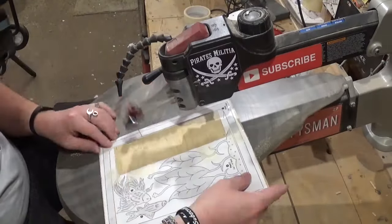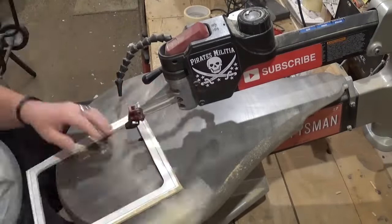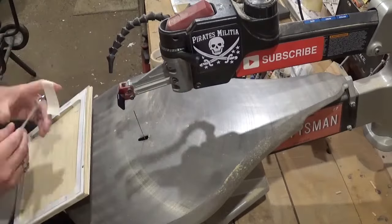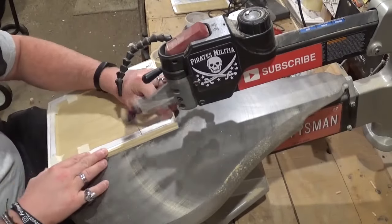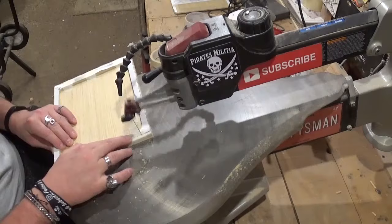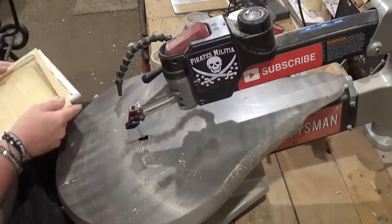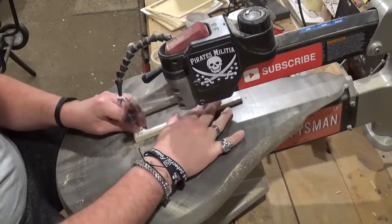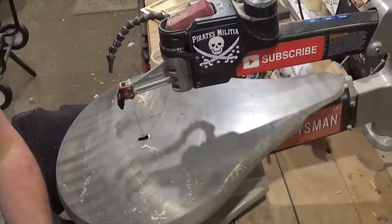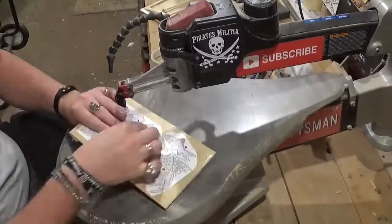Here I am cutting out the front window where you'll be able to see everything. After I get this cut done, I will tape an extra piece of one-quarter-inch plywood to it and go on and cut out the back of the aquarium, which will essentially act as our backer board. Then we will cut out the two sides. For all of the scrolling on this project from start to finish, I will be using number five ultra reverse tooth blades — they'll cut through all the material exceptionally well with minimal chip-out.